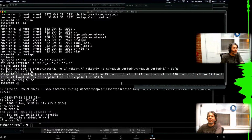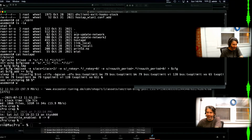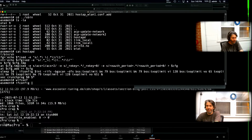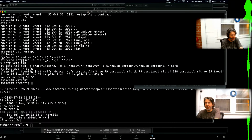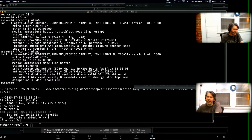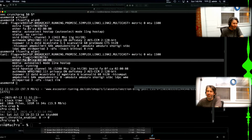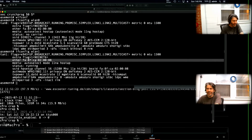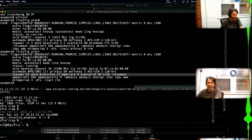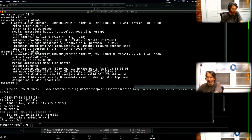So you can get a little bit more time in the air by adjusting your collision sense. Here, I guess I disabled RIFS, reduced interframe spacing. And certainly, you can see I was able to change the MAC addresses. Probably manually adjust the transmit power, and multicast rate of 12 meg.